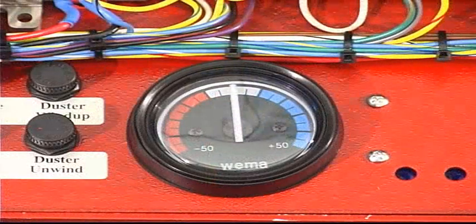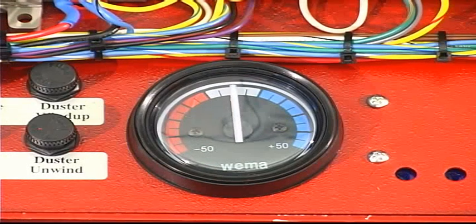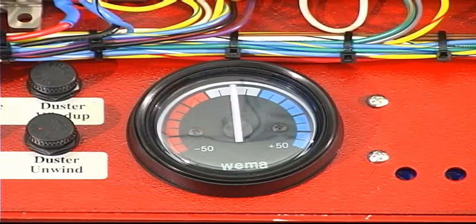To the right of the fuse bank, as we described a little bit earlier in the video, you will notice that there is an amp gauge. This allows the operator to monitor the current power status of the 2 batteries located underneath. For example, when the vacuum motor is engaged, as we will do with this relay and this test button on top, you'll see how much amp draw is being taken by the machine.